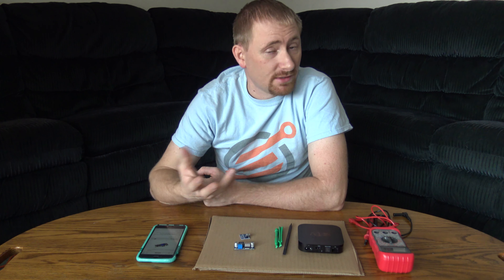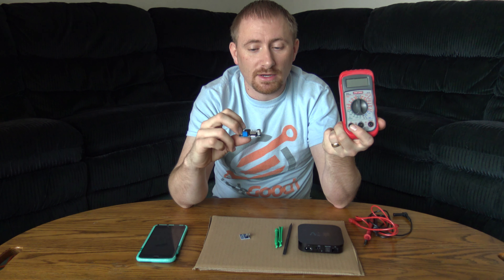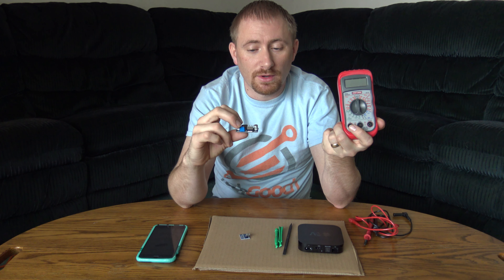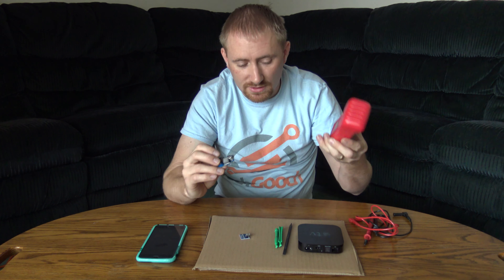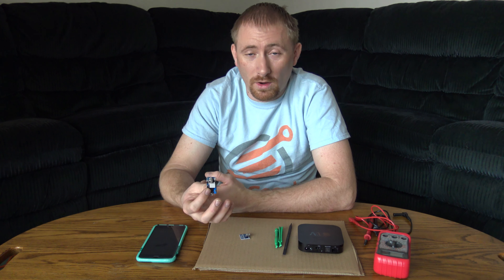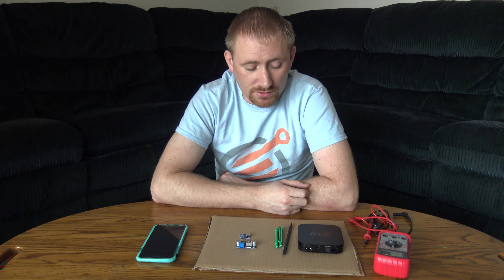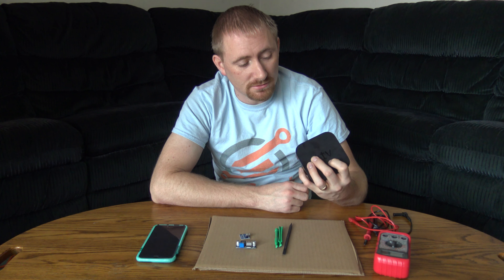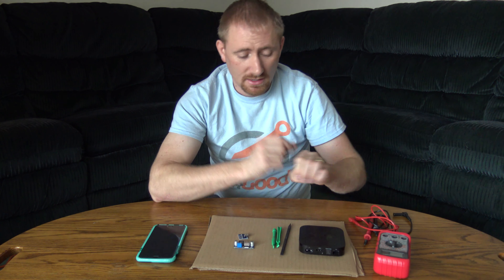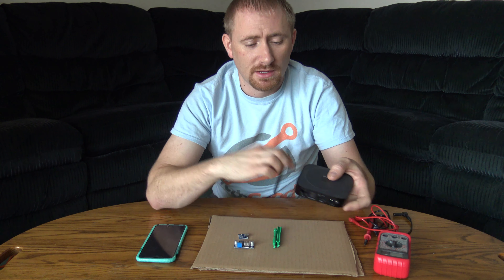You could obviously hard-wire it — that's not a big deal — but this is what I want to do. You'll also need an electronics meter to adjust the DC-to-DC step-down module. There's a little screw on the converter unit and you have to use it to tune the output to 3.4 volts. It only pulls about 1.75 amps, so it doesn't use a whole lot of power.